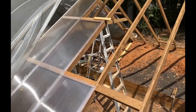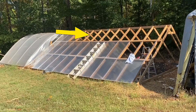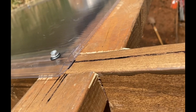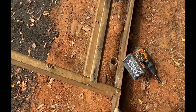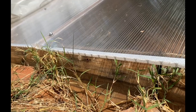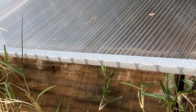The best way to install the polycarbonate is bottom row first, then the second row, then the top. Add the channels as you go. It's impossible to slide a sheet in from the top down to the bottom. This polycarbonate channel was very difficult to get the sheets into. Tighten it up — little screw down here and on top, down here as well. This tape drains the condensation out of the channel inside the polycarbonate.